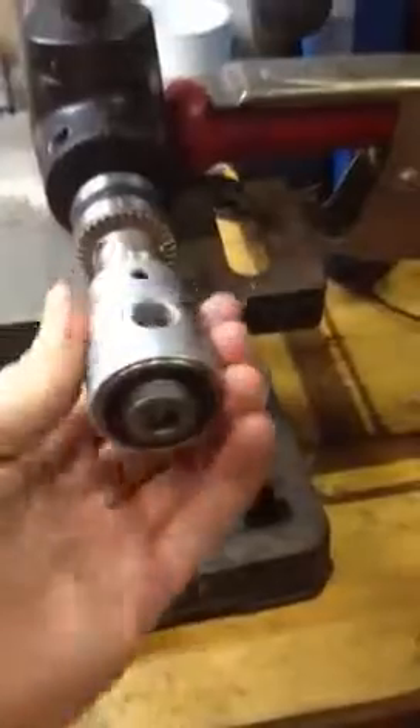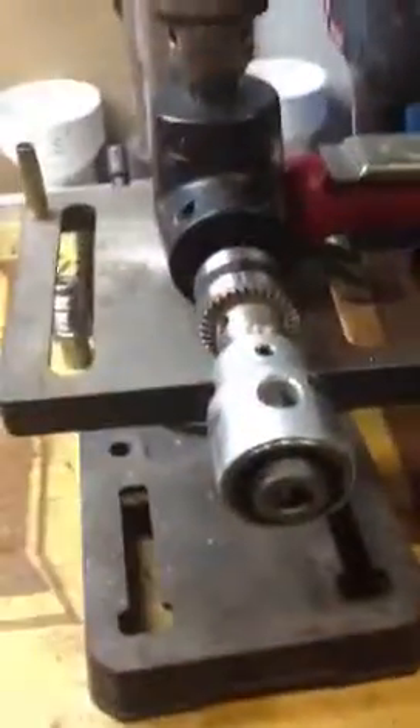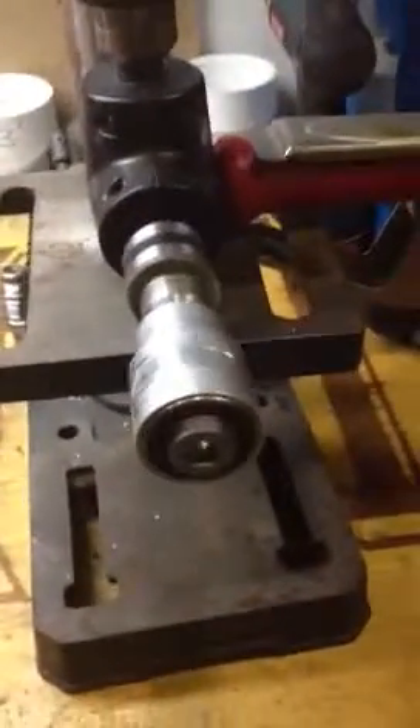It's really fast. To clean it out, just turn it to the side, tap it a little bit, or turn it on and off and a lot of brass will fall out. You get quite a bit of build-up, so don't have any of your empty cases — the ones that are ready to load — laying around unless you plan on cleaning them, because you're going to get a lot of debris.